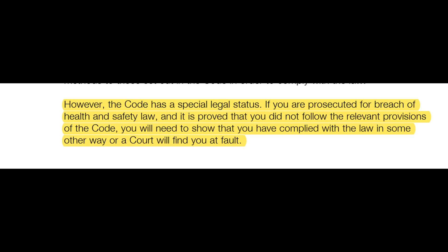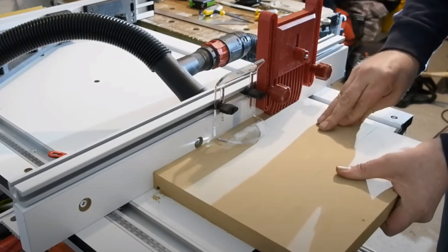What about the router bit Peter was reviewing? I don't have the bit to hand, but I popped the sales website image into CAD. Going off the known bearing diameter of 30mm, I measured the body that wraps in a spiral with the cutters — the body diameter measured around 28mm, giving around 1mm of blade projection. So it seems a fairly well thought out bit — not only legal but compliant, if admittedly a little intimidating like all these giant bits. The large cutter I reviewed also has a very shallow projection — the cutting edge just peeking over the body by 1mm. But what if a bit for a job had a blade projection greater than 1mm? You'd have to show you've taken steps to keep fingers away from the cutter and reduce the chance of ejection — ideally fitting feather boards to the fence and table along with a protective cover over the cutter.